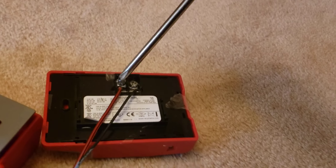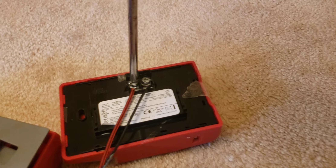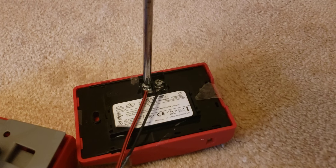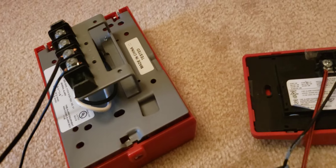About the voltage — you have to use the correct voltage for your alarms. Any voltage between 12 and 24 volts will work. The alarm I'm using is the ESC Genesis, as I already said. This works on 9 volts too. But it depends what alarm you're using. Some alarms won't work on 12 volts — for example, some require voltage between 18 and 27 volts. But for now, let's move on with my voltage.